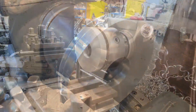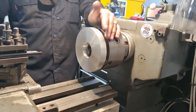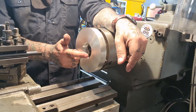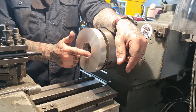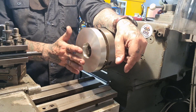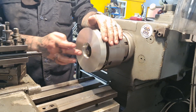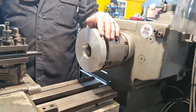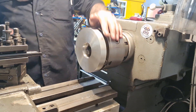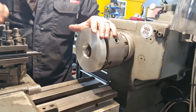Okay, sports fans. We've got that cleaned up. Now what we need to do is cut this centre hole to the same profile as the wheel — the profile we've just formed on the milling machine. This disc carrier is going to sit over the top of it. I've taken some rudimentary measurements and I know I need to go in 7.6 millimetres.